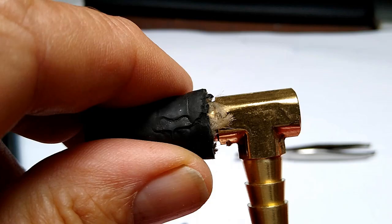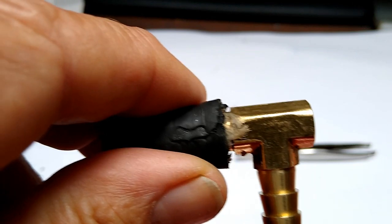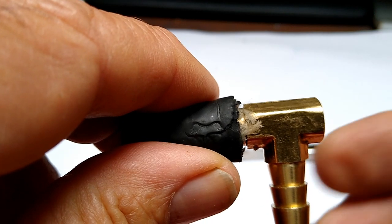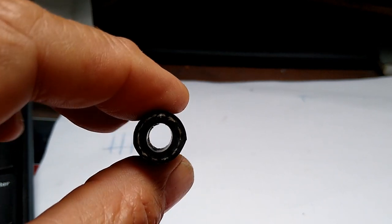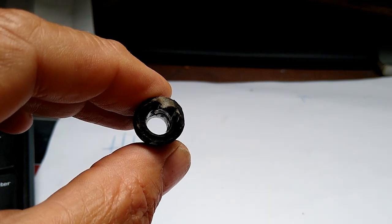So, do you remember that I said there was one fuel hose I didn't replace? Since I didn't have a length of hose long enough, the piece between the fuel filter and the electric booster pump, whilst checked it was clear and in good condition, was reattached, but with a 90 degree brass union to make the routing a bit neater, and I'd done that prior to the service. The barbs on the brass are quite sharp, and I had to twist it back and forth to fit into the hose. This is the hose. It's now just a short piece, so very easy to see through, but it looks okay, doesn't it? No obstructions.